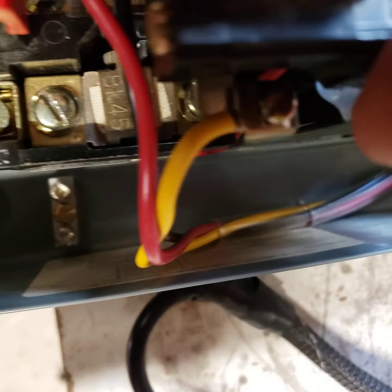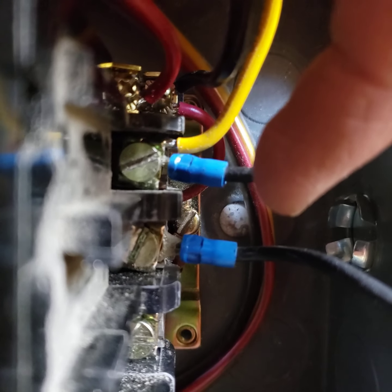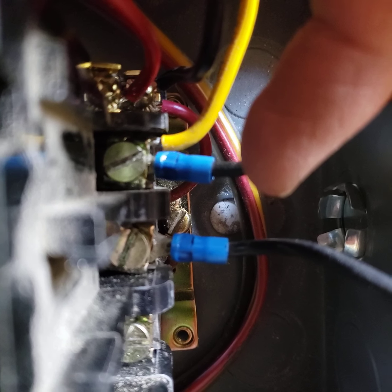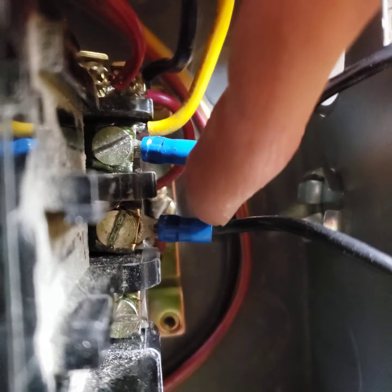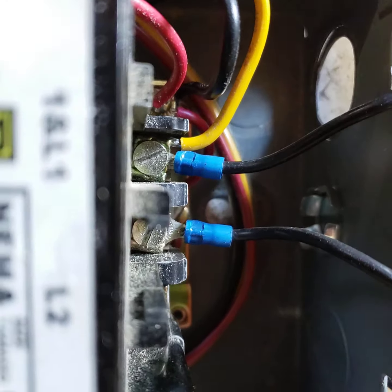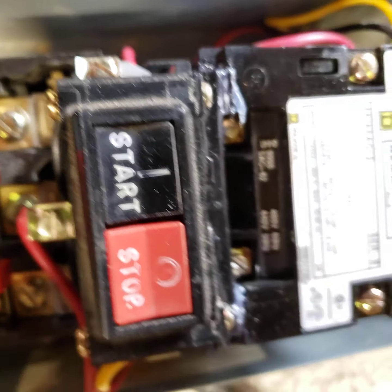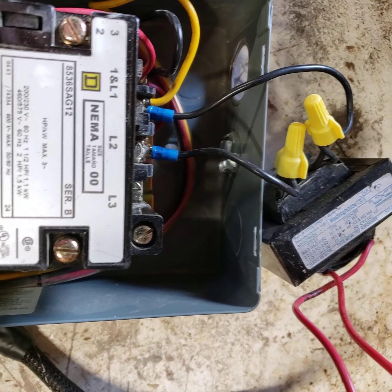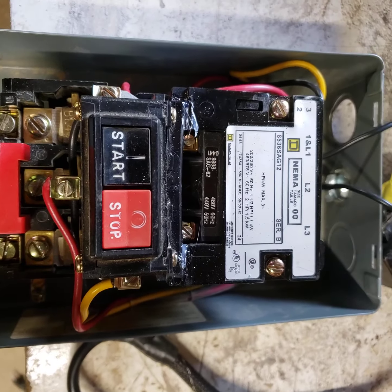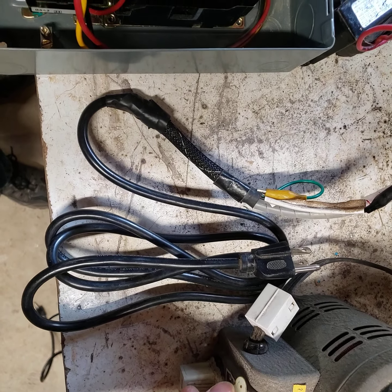The other side of the coil goes out and down over here. The second terminal goes either to that switch in the front or to the coil. I have a little transformer here because I wanted to test this in a controlled environment — I have a variac so I can control the voltage and current.